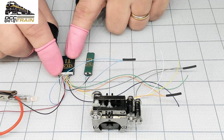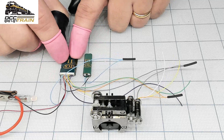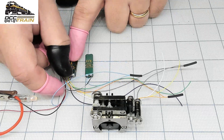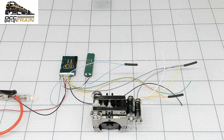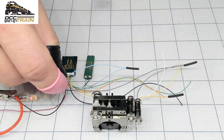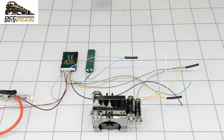I opened the shrink tubing insulation and on the negative of the bridge I put that ground wire — that's the black and white stripe wire. You need some skills to do it, so use good soldering equipment. The newer decoders are already coming with those wires. So let's start it. I'm using the LENZ system at speed step one. I didn't adjust any acceleration or deceleration, but I have power on the first speed step.